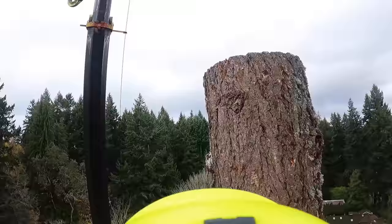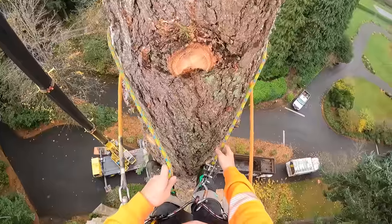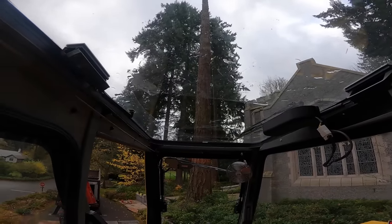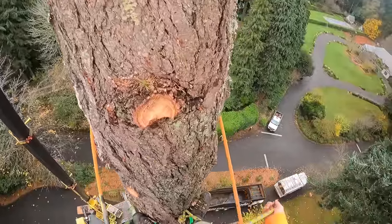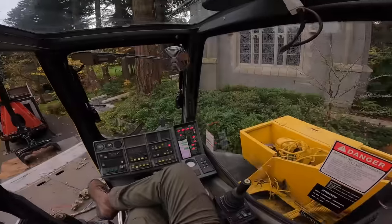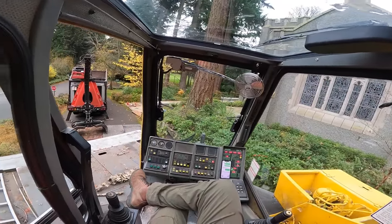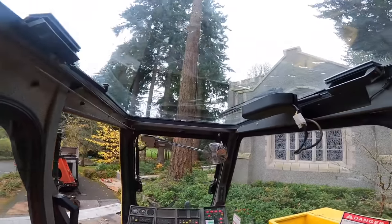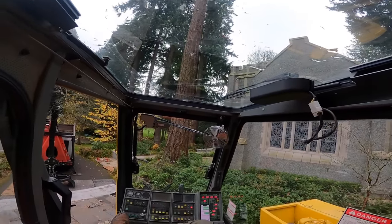And chain's right behind you. Watch those hooks. How much stick do you have out right now? So I've got 125. Is that your whole boom? Yep, that's everything I've got without the jib. Well, it looks like we're about the perfect height. What do you want to do for lengths? Also, what are you good for? So I'm good for line pull, which is 10,000 pounds. I'd love to be picking in like the 7 to 8, maybe even 5 to 6 to start, just until we get a feeling on the weight.